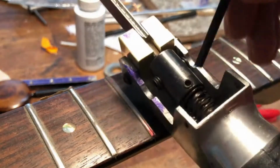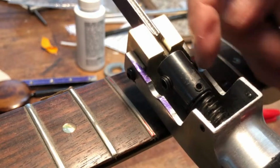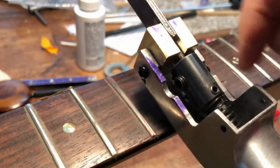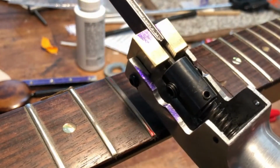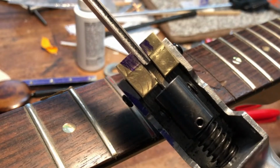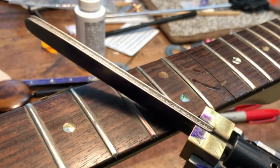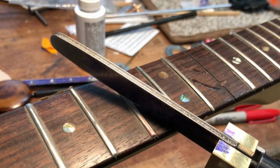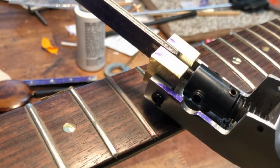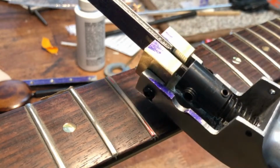Not much to it. This thing here, you've got to really check the set screws on it because it threads onto the shaft, and it worked its way loose, and those things vibrated out of there. I would consider using some Loctite on them after thoroughly cleaning it. Is red tougher than blue, or is blue tougher than red? I used to use blue, then I started on red. Once you settle on a file, do you think you'll Loctite that thing in, or do you think you'll start looking for a little bit better pneumatic recip saw? Well, I'm going to get the red one that Danny has and see what I can do with that.